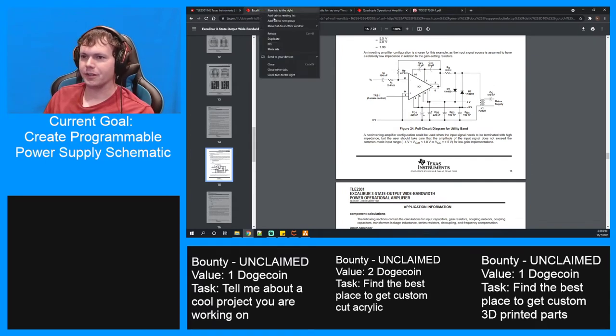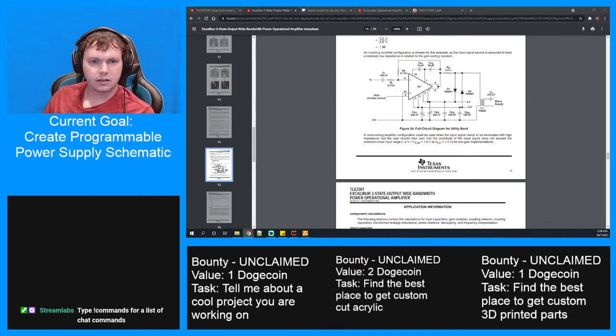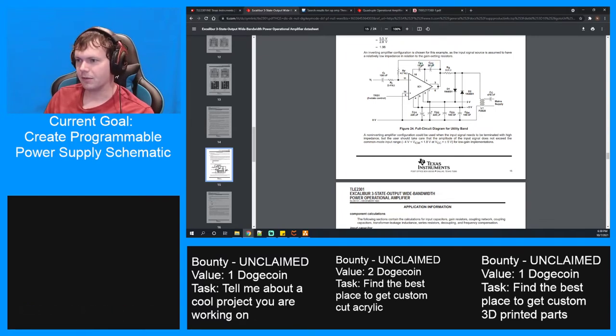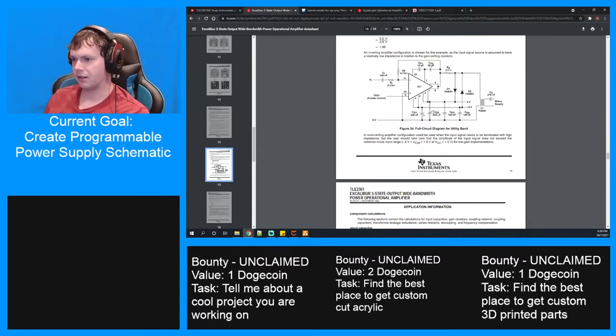I really need to look at what all these pins are. Let's see. So, just so we know, pin 1, 2 versus pin 16 versus the output. Okay, so these capacitors are probably required. The caps connected from 0 volts to the negative are probably not required. The ones that are going to the positive are probably required. The diodes, I'm not so sure about.